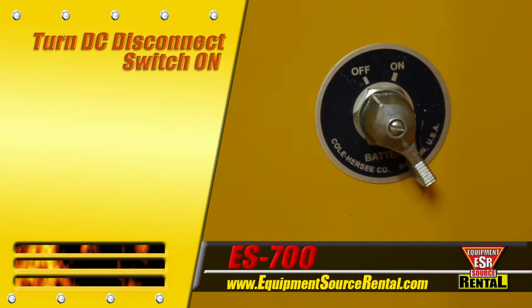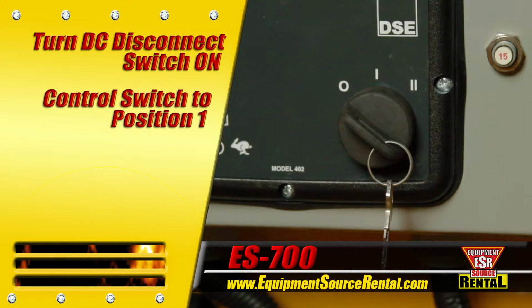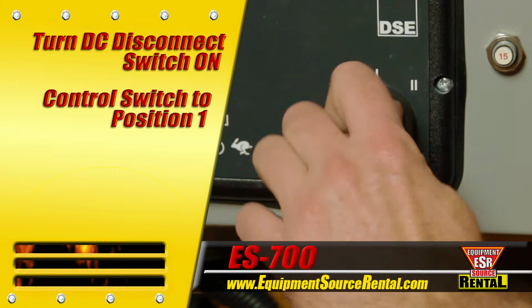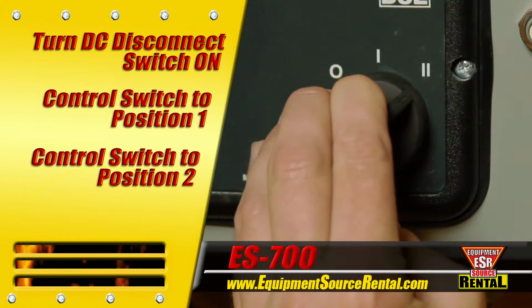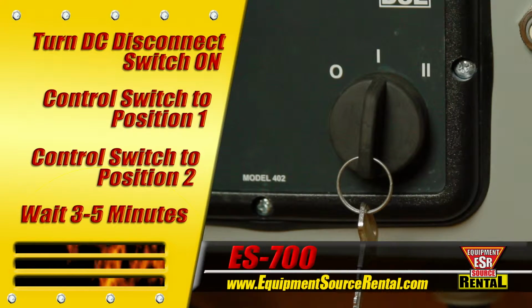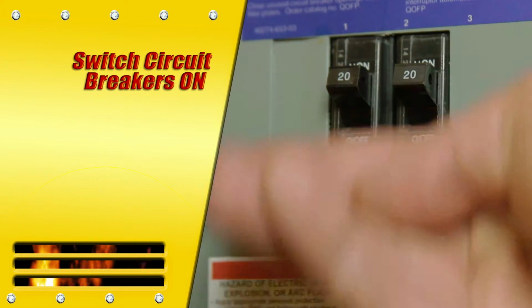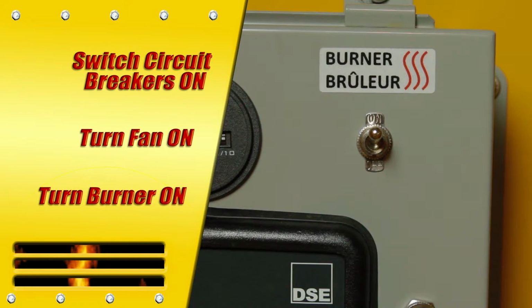When you're ready, start by flipping the battery disconnect switch to the on position. Next, turn the key switch on the control unit to position 1 for 15 seconds. Then, turn the key switch to position 2 to engage the starter. Let the motor warm for 3 to 5 minutes. Switch the circuit breakers to the on position. Turn on the fan and toggle the burner control switch to on.